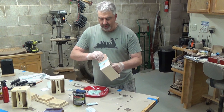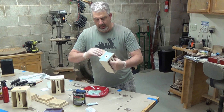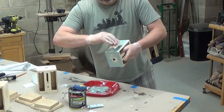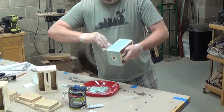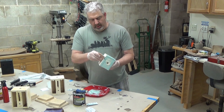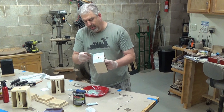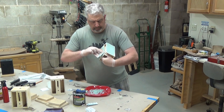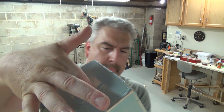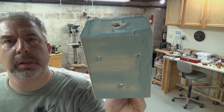I'm not trying to flood the surface — I'm just going to try to get it on all the seams a little bit, not a whole lot. It doesn't need a lot. Put some on the flat parts too just to fill in the grain; apply it real thin. This stuff does not mind being applied thin — it's kind of what it's designed for. The Durham's I'd say is more for scratches, digs, and gouges. After just a few minutes of filling in the cracks and large grain lines, this is what it looks like. Bondo cures really hard, so I was careful not to put on more than I needed.